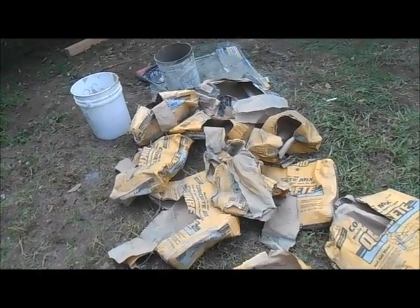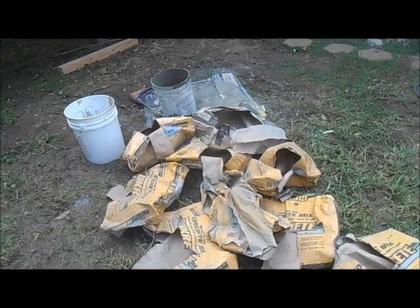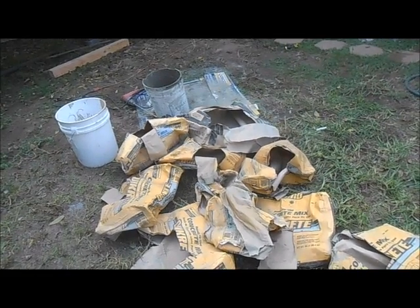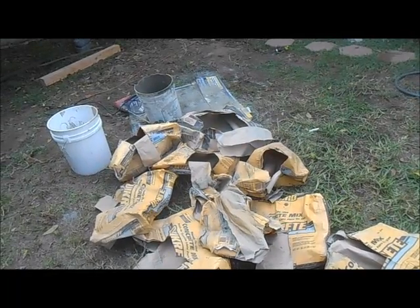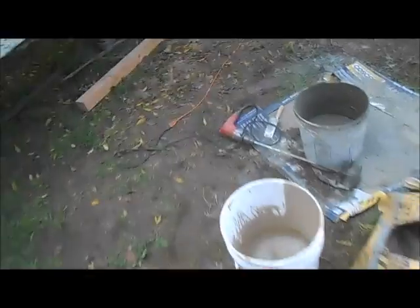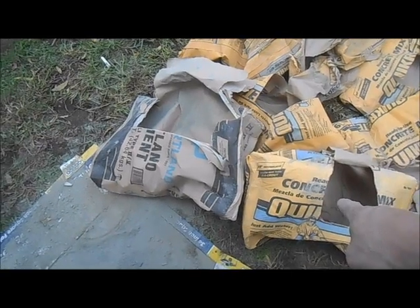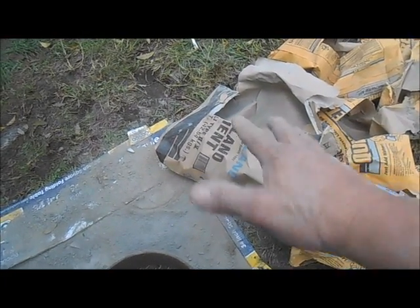A customer hired us to do some repairs in her crawl space. You can see the beams were sagging anywhere from 3/4 to 1.5 inches. And so we jacked up all the floor joists, reposted and beamed it. Installed 21 concrete piers. What we like to do is put the regular concrete, and this is 4,000 PSI. Then we'll put 3 or 4 scoops of the regular Portland cement in there, so it gives it a little bit stronger.